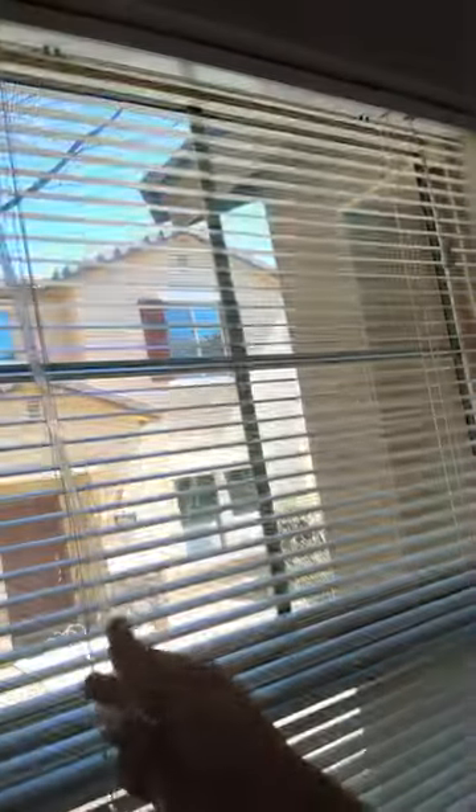These blinds will get replaced. When you're up here looking at the windows, look at the top of every windowsill and make sure you don't see any water damage — you'll often find it there. When you do, let them know, because that's more money you get to make fixing water damage. Test the blinds. The screen looks fine. Window locks are often broken or missing — make sure you check those. Make sure all the blinds have the wands. This one might get bent back into shape since it's aluminum.